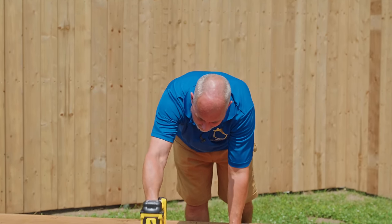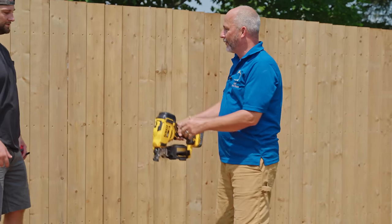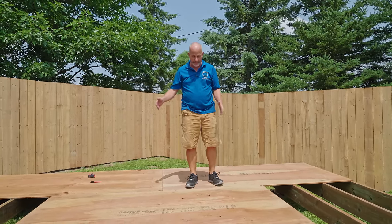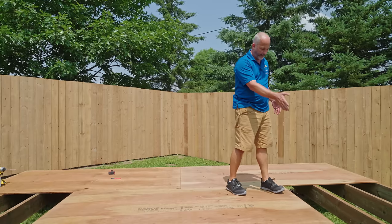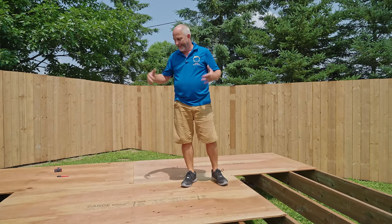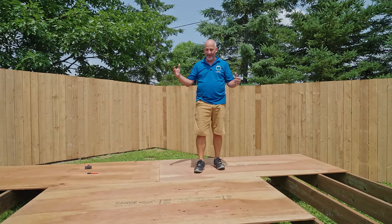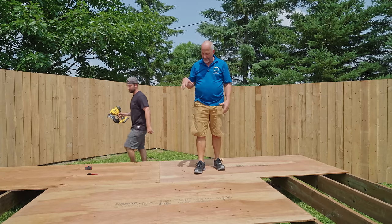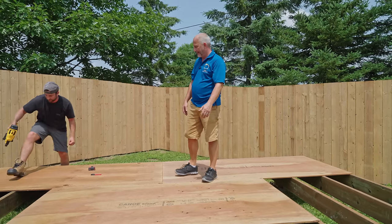It makes quick work of it, and like I said it's just a shed. Now it's also good construction practice to stagger your joints — we'll measure from the right side of the sheet, cut that off, and put the other piece on the other side. It's still 16 feet after all, so we don't necessarily need to go through that extra effort, but it provides a little bit more stability for lateral movement of these joints.